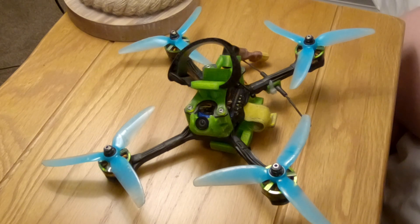Welcome to another video. Today I'm going to teach you how to fix the Omnibus F4 V6 and the Typhoon BLHeli 32 35 amp ESC stack. The issues we've been having — well, it flies great, really well, up until the point where you crash, which everyone does. Every time I crash, the plug that runs between the ESC and the flight controller keeps disconnecting. You then have to strip your quad down to fix it and push the plug back in. I've come up with a little fix that takes two minutes — you just need a hot glue gun.